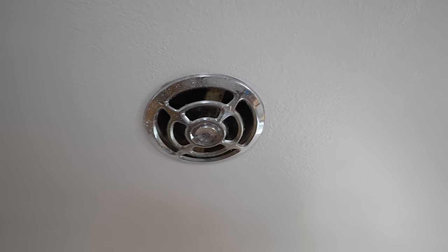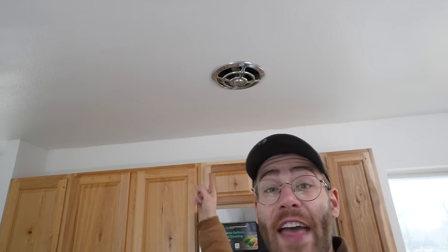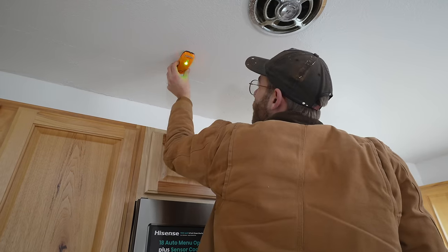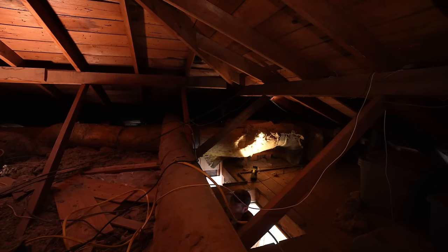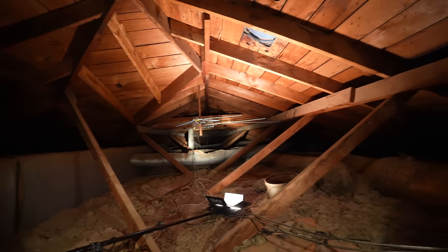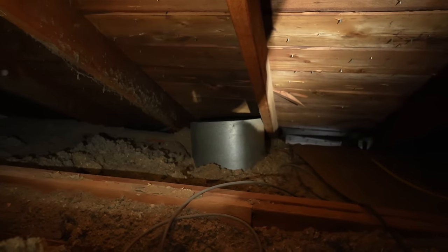There's a vent in the ceiling but it is not ported through the roof — it exhausts smoke, grease, whatever, just into the attic space, which is not great and probably not up to code. That means this microwave vent hood combo is an even bigger improvement than I was initially planning. The center of our cabinet also looks to be right in between our two ceiling joists. Before I drill though, I'm gonna climb up into the attic and double check to make sure I'm not gonna hit any framing or wires, and also hope the roof rafters aren't in the way.